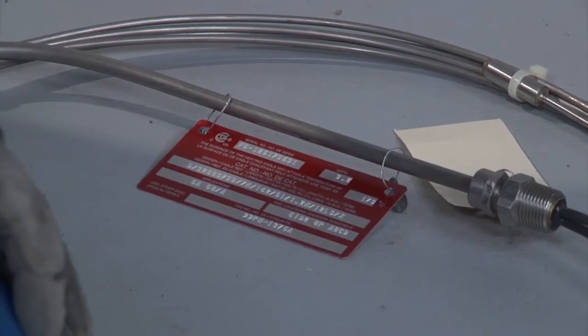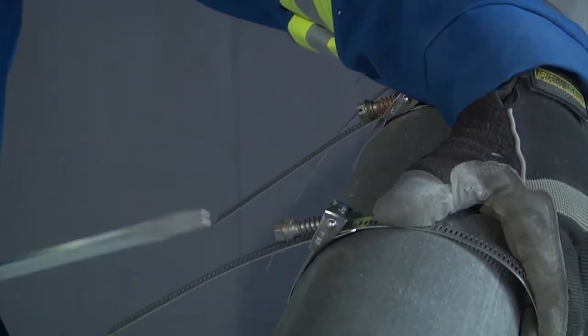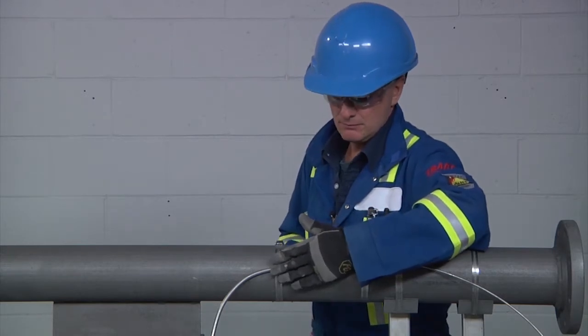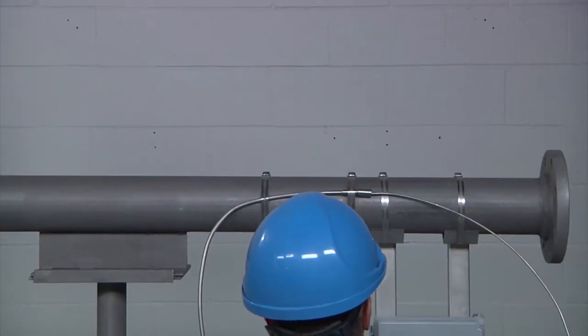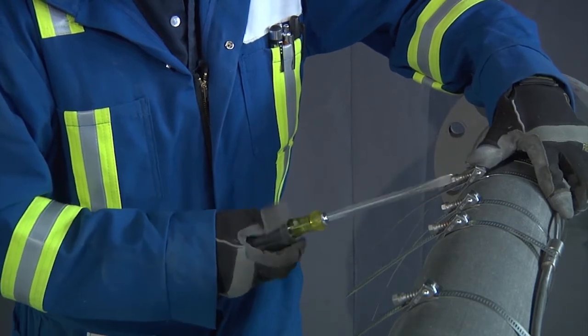The cold lead portion can be easily identified since it will have the XMI heating unit tag attached to it. Using pipe straps or banding, attach the cold lead to the end of the pipe nearest to the power supply point. The hot-coil joint connects the cold lead to the heated section and can be identified as the larger diameter transition portion. It is critical that the hot-coil joint is handled with care in order to not damage the conductors inside. Ensure the cable is not bent too close to the hot-coil joint and maintain a straight section of at least 6 inches (150 millimeters) on either side of the hot-coil joint, and secure the joint itself to the pipe with a pipe strap or band.